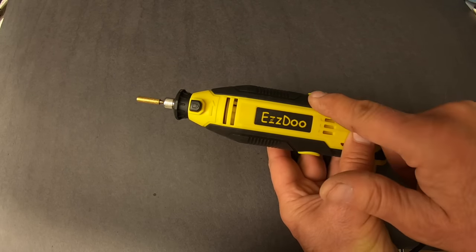This is the top plate. This one I have not sharpened yet. And I'm gonna keep track of that one because I'm gonna spin to a really bad tooth here. Because there's a couple coming up that are pretty bad. Right here, this one. This one's real bad. You can see the top plate's got a curve to it. The tip of it's gone. This next one right here is all raggedy. This next one right here is kind of curved and it's raggedy. You can see it's pretty bad. So we're gonna go back to that one that I left off at and we're gonna start there and then sharpen.